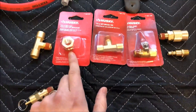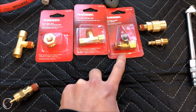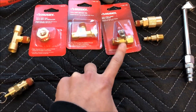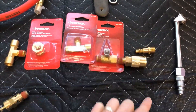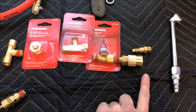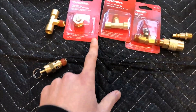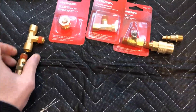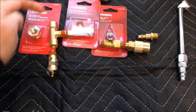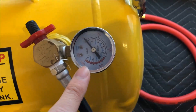So essentially, come off the tank and tee it off. One side of the tee will go to a ball valve, the ball valve will then go into the quick disconnect. I'll use this quick disconnect so that I can then run another hose off of that. And then on the other side of the tee will be another tee. At the bottom of that tee, I will put in the pressure relief valve. And on the top of this tee, I'm going to use the old gauge that's off of the original tank.